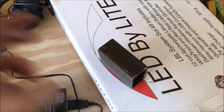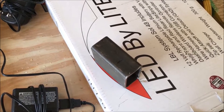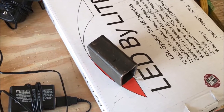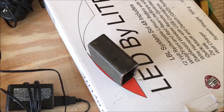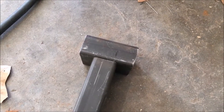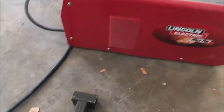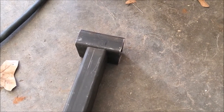Now that the first part has been done, next thing I need to do is weld the bottom bracket back on. The funny thing about it is it needs to be wider than it currently is so that it can fit around the other piece of steel, and they're exactly the same size. So if you look very closely, you can see the line that I'm going to cut it at. To be able to cut it at that line, I'm going to need to weld it onto another piece of pipe that I've already attached to my welder, and that should hopefully allow me to cut these apart so I can start to build the bracket.